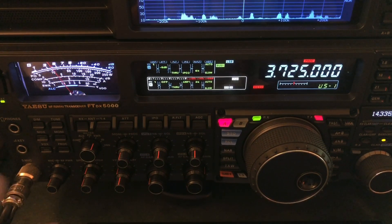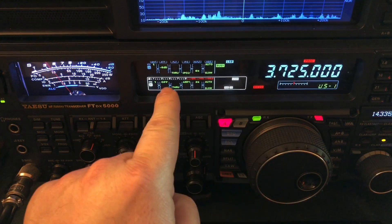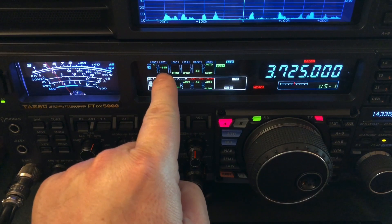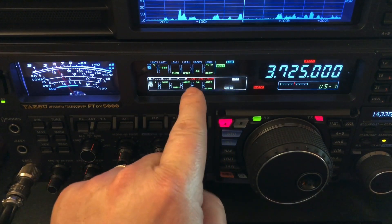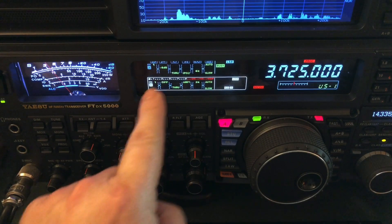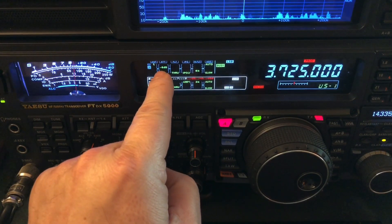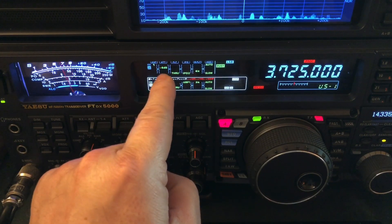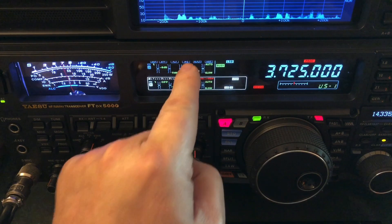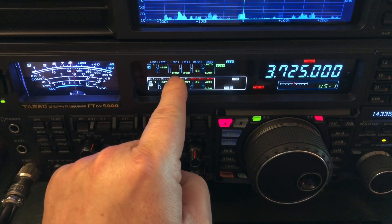I want to attack noise from the antenna end. I like the way the FTDX5000 is laid out because it's actually laid out in order of those circuits in the receiver. For example, right here — attenuation. And if you remember from the block diagram of the HF receiver, attenuation was the first stage. Then you had pre-selectors or bandpass filters, and that's what you're looking at right here.